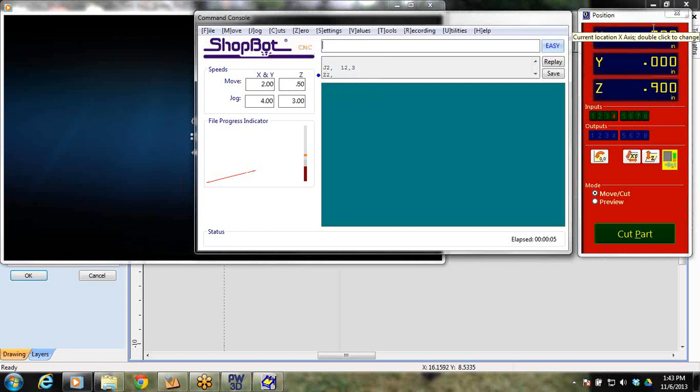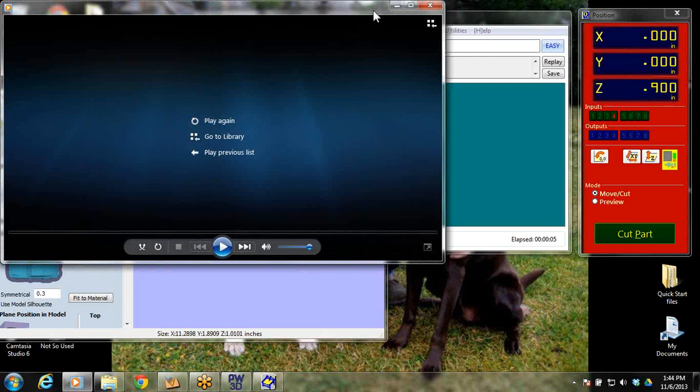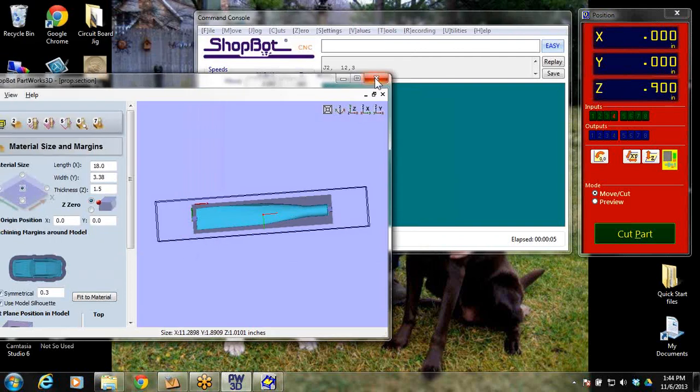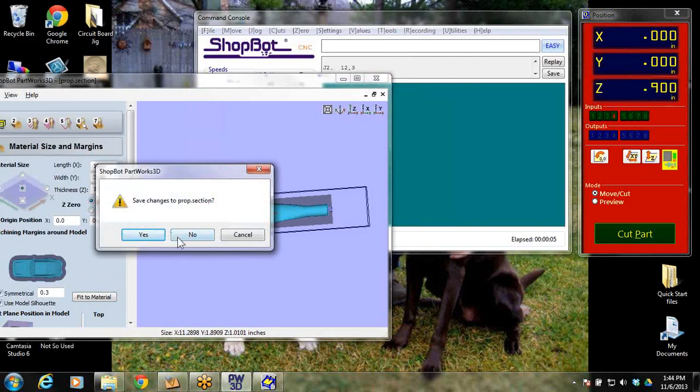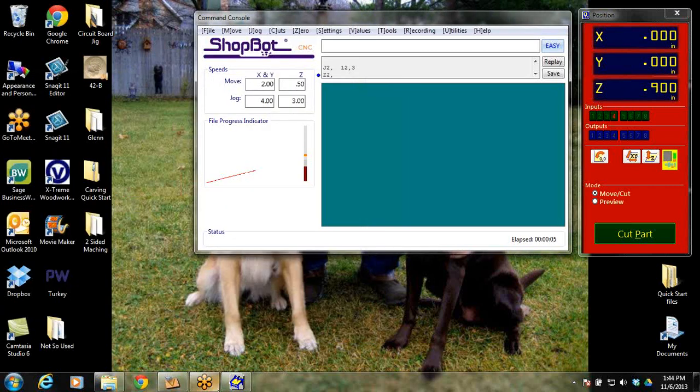All right, another thing that I recommend doing is making a 0, 0 grid with 2 lines. Take some drawing lines and snap them at 0, 0, toolpath it, and have it just come out a little bit past. And let me show you the video for that one. I'll close a few things so we don't lose communication here.